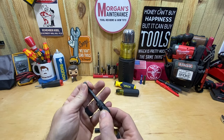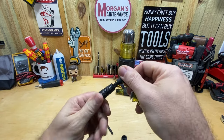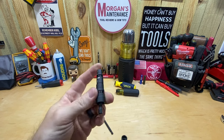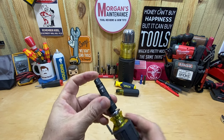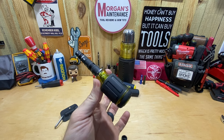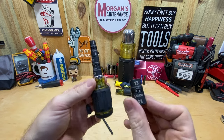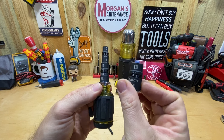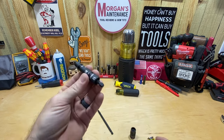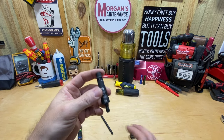So I would say no, you can't use the 1314 and the 1012 together. However, you can use the 1012 with the 7/8 — I've got that seated all the way down and I'm able to grab a hold of it. So you can do 1012 and 7/8 on the three-inch shaft, but you can't do 1314. You just don't have enough shaft to get all those on there at one time.